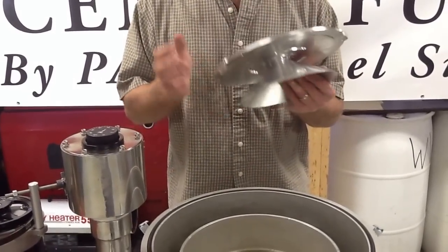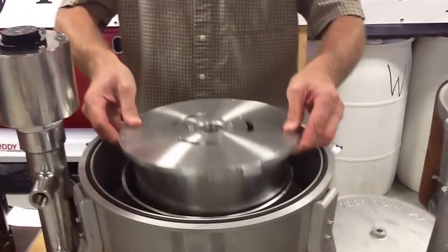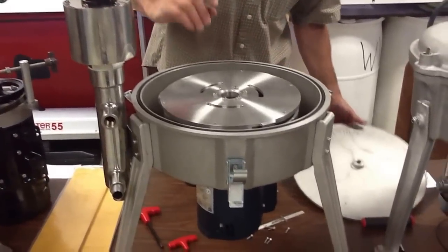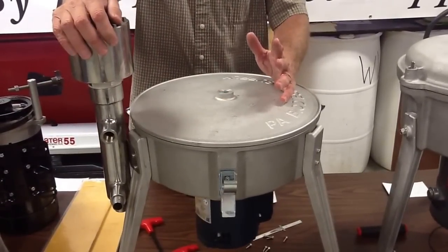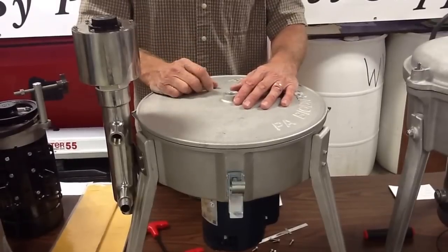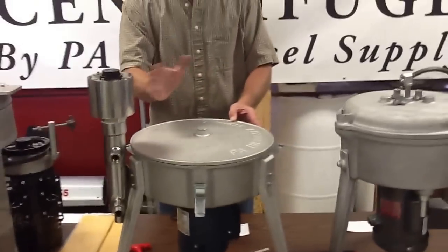We have an accelerator included — it's not an extra. Just us and Simple Centrifuge have that. We're offering our inline heater, which bolts right up to the leg — stainless steel housing, EC approved, 1500-watt inline heater. I'm going to show you a movie just on the inline heater. You set this at 160 degrees, but depending on what the oil flow is, if you're flowing it too quickly, you could set it at 500 degrees and your oil might still be 120. We'll show you how you can monitor that, and we might even put out a chart that correlates with flow rates.